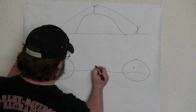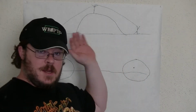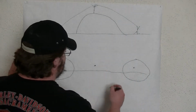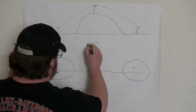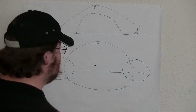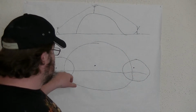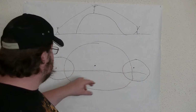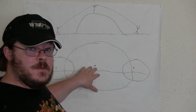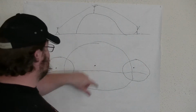But once again, if you put a repeater in the middle, and normally a repeater has a big antenna, a lot of height, more power, things like that. Radiation pattern for a repeater is going to be this big, more or less, okay? So now, as you can see, our radiation patterns from our handhelds are within the radiation pattern of the repeater. So now we can talk back and forth through the repeater. Okay.